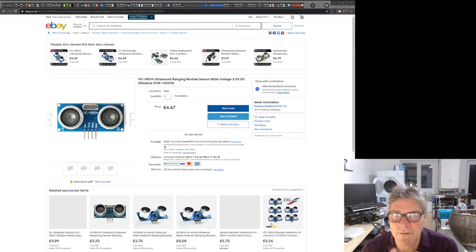Certainly for prototypes, I've got things like the FPC connectors for the cameras. I've got the tile main connectors, so it's 1.27 pitch. I've ordered a bunch of stuff from Ali as well to help. I've got the stuff to do the ESP32s and the Wi-Fi. I've got some USB sockets, some C's. I've got the flash, I've got the Quad SPI RAMs. I've got some of the diode stuff. I've got some of the RGB LEDs.